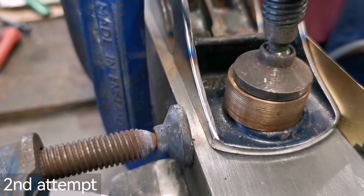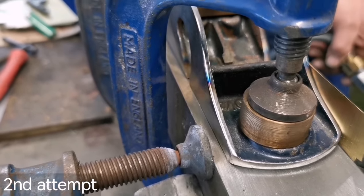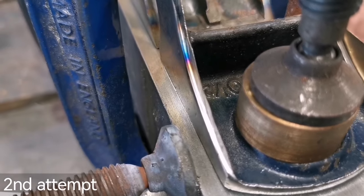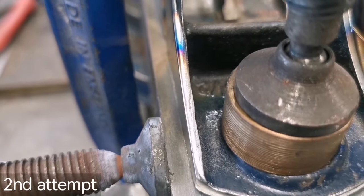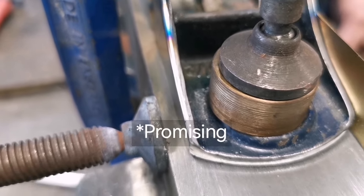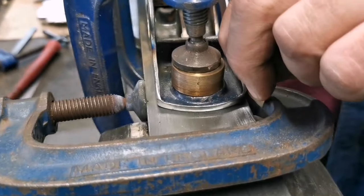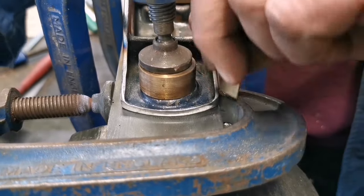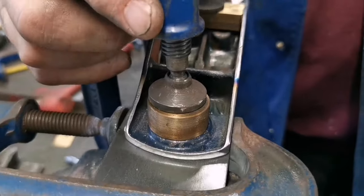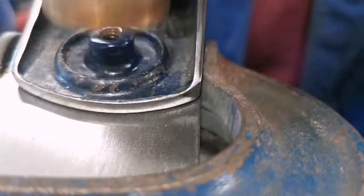I'm going to add that the scribe line you put there earlier, very much like when you use a pencil, if a scribe isn't razor sharp, that scribe line is under the radius of the corner. There was a tiny gap before. Now there isn't a gap, so that's looking really good. We pop that, we slacken that off. It doesn't go in now, so we've moved that already. So now it's that one. If we just back this one off, it's whether or not that gap closes.